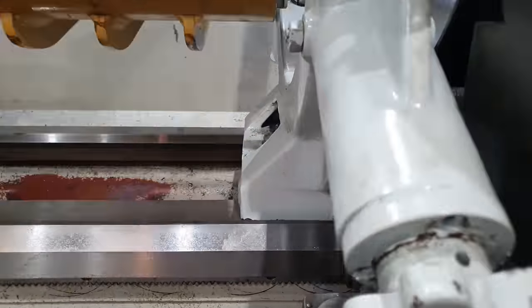Whoa, 0.6 mil tighter, the top side, just zero this. Come back down again. Yeah, 0.6 of a mil loose, bottom side. Now that we've got the barrel set up like that, we have 0.6 of a mil oversize on the bottom end of the strut. There is a lot of wear throughout the wear band area, so I'm going to have to talk to my customer because the repair this came in for, which was just building up that lip that has ramped out, it's not going to work.